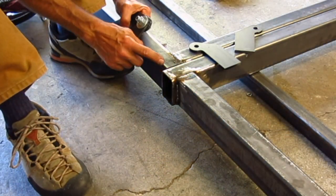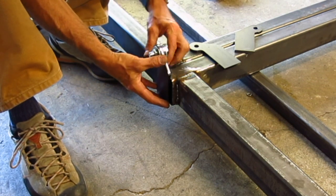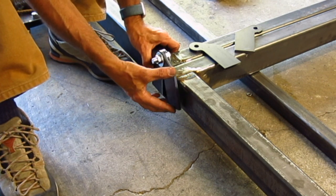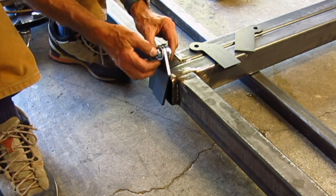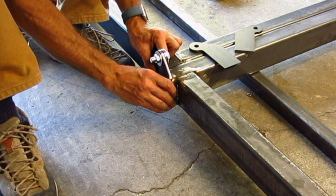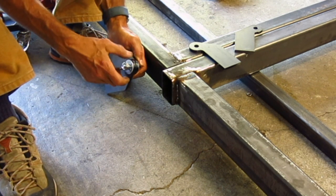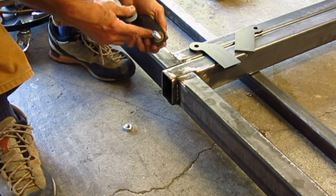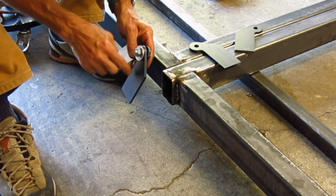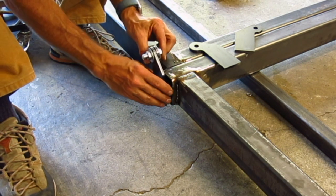So the reason I have this step in here is because of the way the hinges work on each other. The idea is I tack and weld these two plates on the outside of these guys here, and then they're able to swing up. The offsets of everything I have here for these plates is basically the same as what we're seeing right here — so that works out pretty good. I've got one of these little bronze thrust washers here in the middle to kind of bush everything out. This bolt isn't going to be the ultimate bolt — ultimately I'll get some shoulder bolts, specifically a half-inch shoulder bolt, which will be the way to go on this thing.